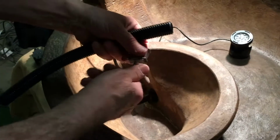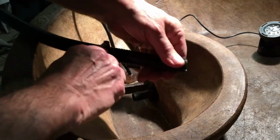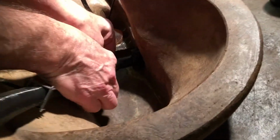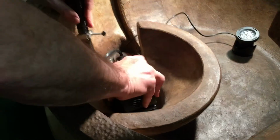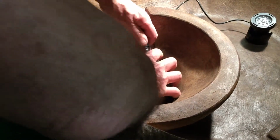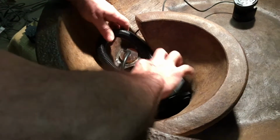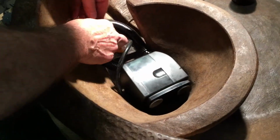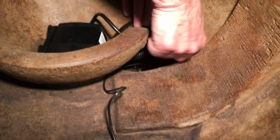So now we have our tubing and the restrictor. Open it up all the way so it'll fit on the 3/4 inch tubing. Then take one end on the barb. Drop the pump in its place again, and then connect the tubing onto its barb. I'm going to lay the pump down at an angle so it's clear, and get this restrictor in a position so we can get to it from the outside nicely. And then you can give it a couple turns so it's snug.